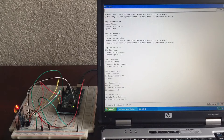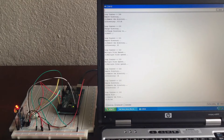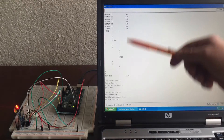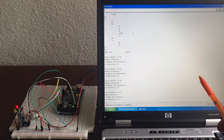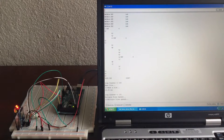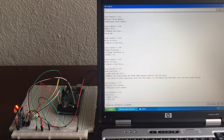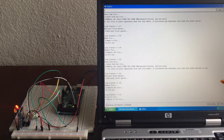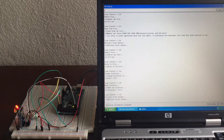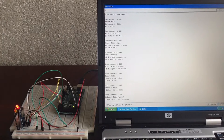The issue I want to note is this is also on a Mega. Initially I'd written it for an Uno and the Uno immediately ran out of memory — this list directory would start losing characters and file names at the end, going out three levels. So I started using the Mega, which gives me 10 times the amount of memory as an Uno. I also show in this sketch how to save SRAM, which you use primarily when doing print statements. It is far smaller than regular memory.